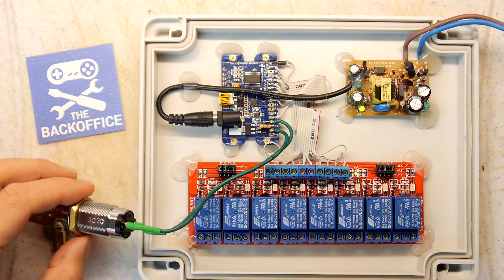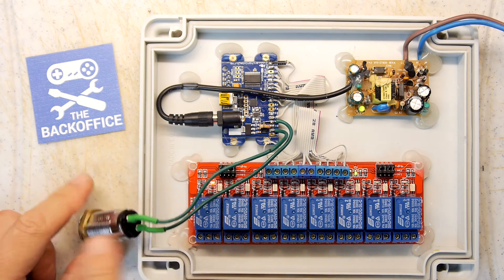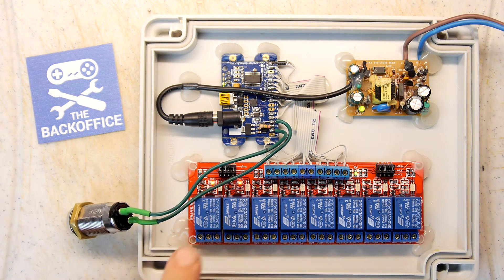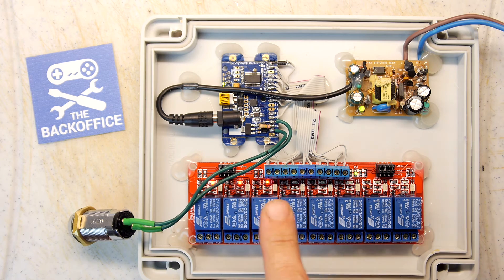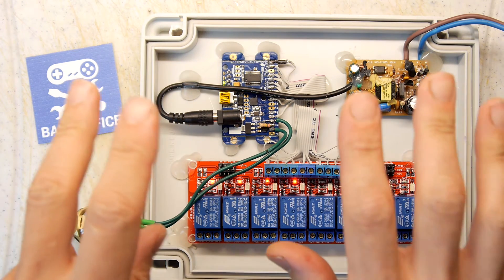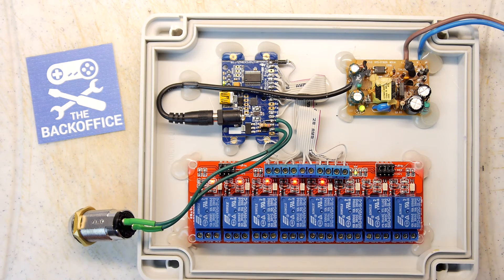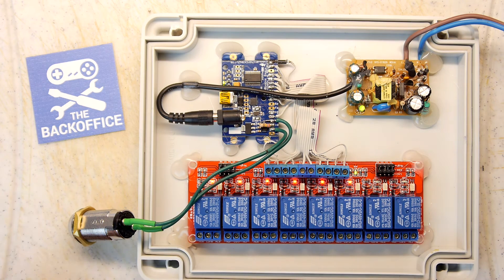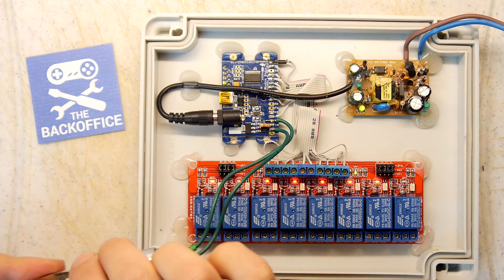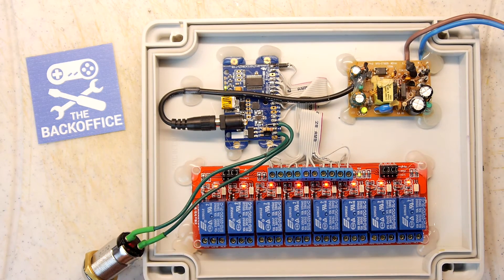When you operate the switch, the booby board will see it and go through its sequence. I toggle the switch and I can let go and walk away at this point. You'll see the first LED and relay come on, then the second — there's quite a delay because these are turning on arcade machine cabinets and waiting for most of the degauss cycle to complete. It goes nicely through its cycle. You can have up to eight arcade machines or eight devices off this. If you operate the key while it's mid-cycle, it won't do anything — it's set to ignore input mid-cycle.